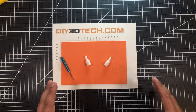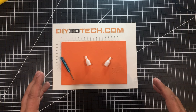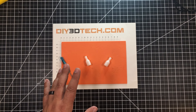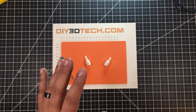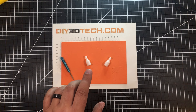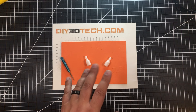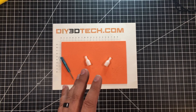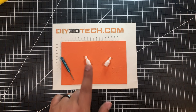To do this, this needs to be a watertight fitting. So one of the first things I do when I design a flange is keep in mind what nozzle size I'm going to print with. I typically print TPU with a 0.4 nozzle. I do that because it gives me the best balance between detail as well as adherence. I can print with a larger nozzle, say 0.6 or 0.8, but I'm more likely to have gaps with a larger nozzle than the smaller one. At least that's been my experience, so I stick with the 0.4.